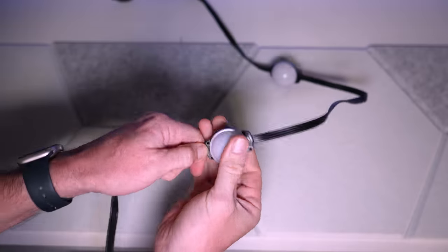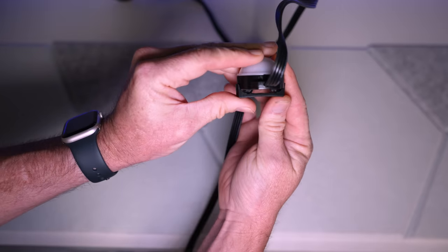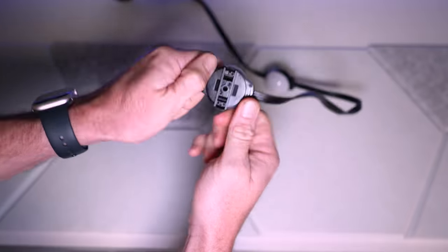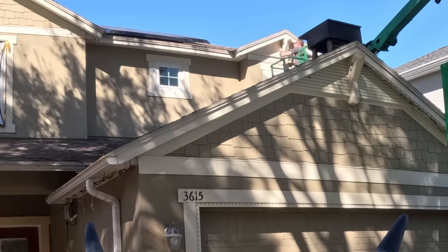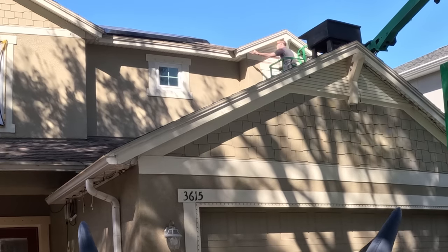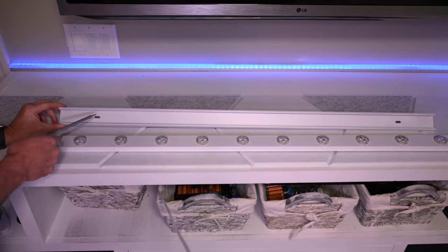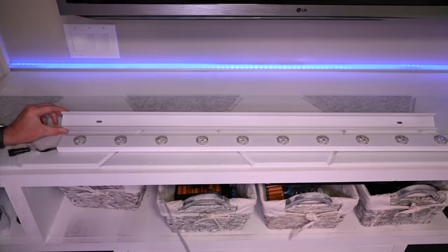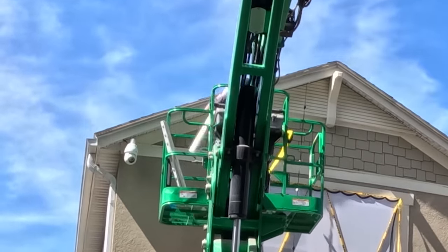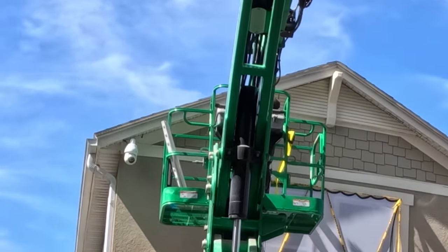The Novastella kit comes with plastic brackets that are meant to be screwed into your soffit, and then each LED node snaps into the mounting bracket. Once it's in, the bracket is extremely stable, but getting it aligned just right to clip in can be difficult, especially if your soffits are flimsy. I'd personally not be comfortable installing the Novastella kit on a second-story roof from the top of a ladder, so a man lift rental is highly recommended for that kit. The YPS channel installation only needs two screws per segment, but it can be difficult to hold the track and your drill overhead at the same time on a ladder. I'd recommend putting some double-sided tape on the track to hold it in place while you get your screws installed, though with the man lift I found it was pretty simple to keep everything in place without any tape.